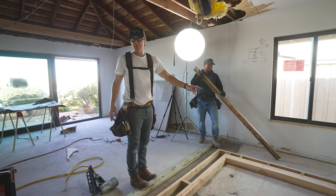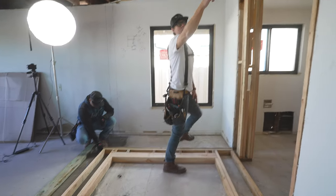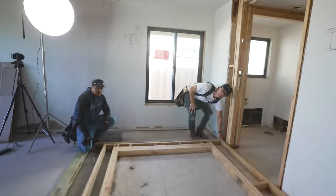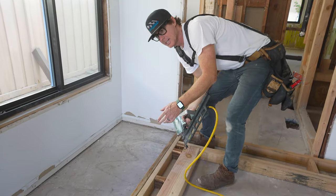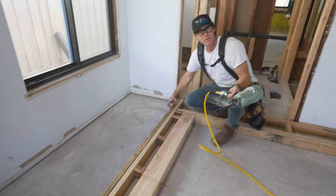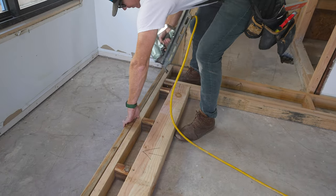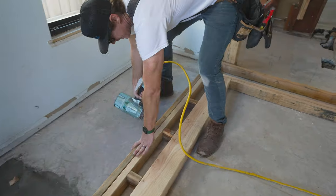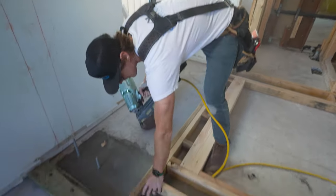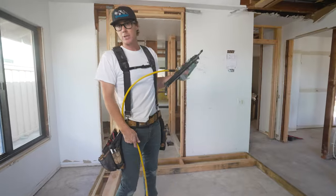Blocks are in and everything else is ready. Now we want to put our second top plate in. The top plate runs five and a half inches longer in this case. The top-top plate gets nailed with two nails on the very end of the wall, and then one nail staggered — up, down, up, down — in each bay, every 16 inches. We're stitch-nailing the plates together. Two on the end, then staggered every 16 inches in between. This wall is now ready to go up.